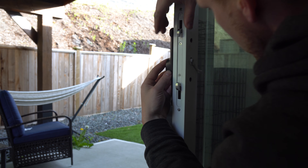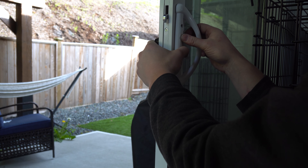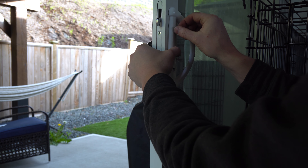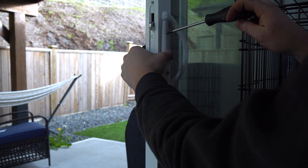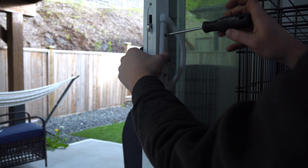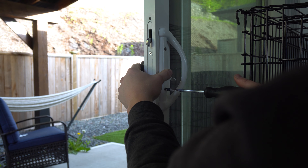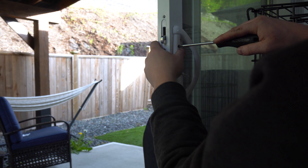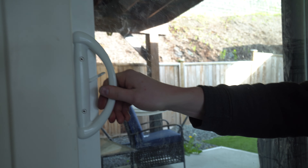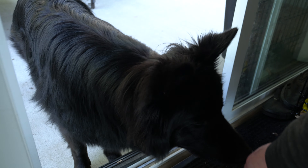This side of the handle — I'm going to line it up through here so I don't cover your access view. That just lines up like so, this goes like this. Take your screws, they thread right through. Just finger tighten whatever you can. Here's another trick: back turn, then tighten — the back turn can help line up the threads. Don't go too ham on this; you don't want to compress the door too much but you also don't want it too loose. Let's see if we can lock it — there we go! Thanks again for watching, have a great day, hang loose.